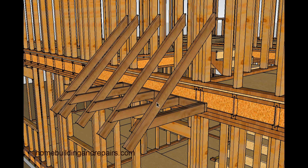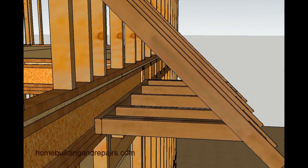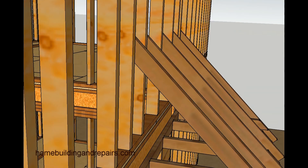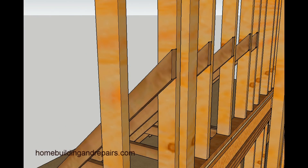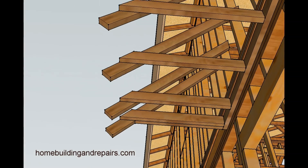This type of porch extension is going to be a little bit stronger. We sloped these at a 45-degree angle. The framing members here might need to be 4x4s — they might need to be a little stronger than a 2x4, depending on how much weight is going to be on this. A 45-degree angle gives us a nice brace, so this whole roof system is going to be stronger than the one I just showed you. You can see how it's braced up against the wall studs. The next section of the video will show the same roof with a little more bracing on it.